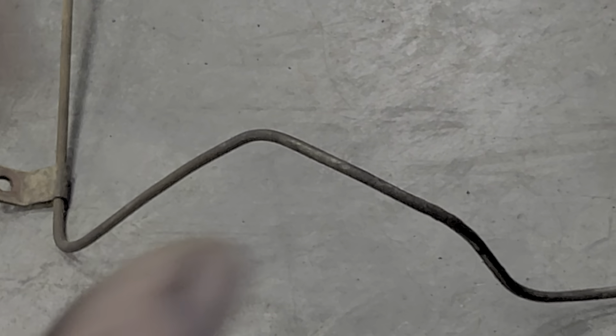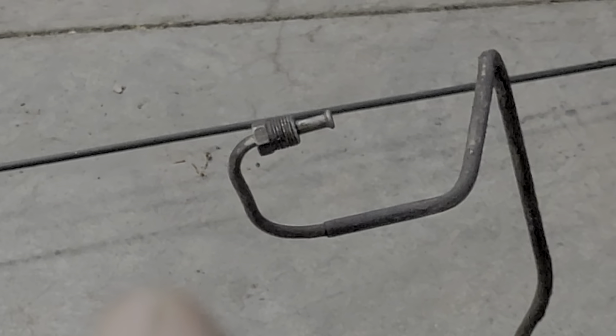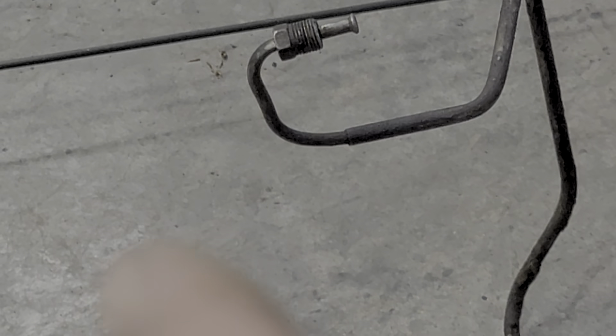And after I bend this 90, then I'll tie it again. Then I'll put switch positioning in my bender and I'll bend that up at an angle, just like it is there. And then I'll tie that and use my bender and just carry on until I'm finished here. The last one is not easy because it's a complete 180 there.